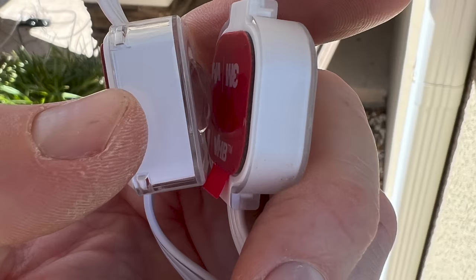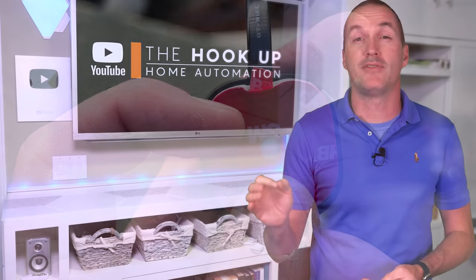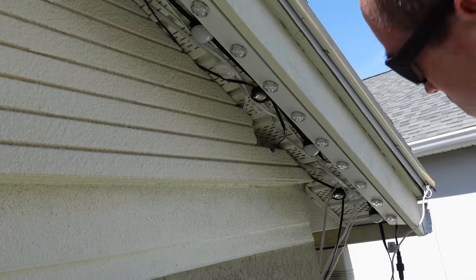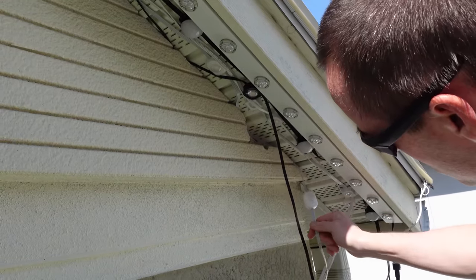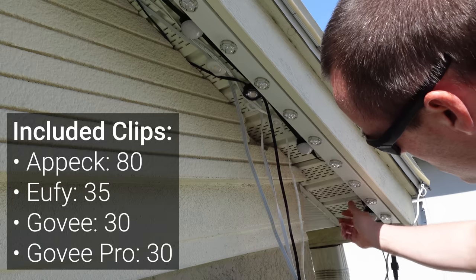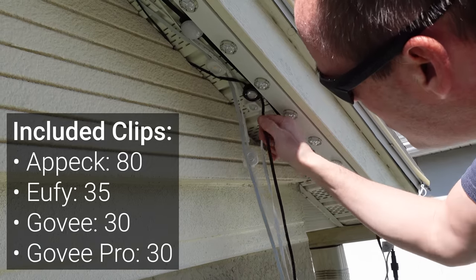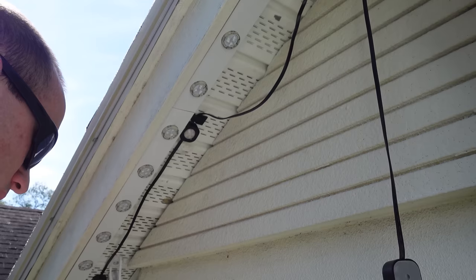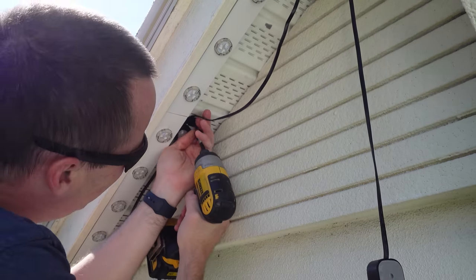The APEC, Govee, Govee Pro, and Eufy lights all come with 3M double-sided tape on the back, but each kit says the adhesive is only meant for temporary installation and that screws and clips should be used for permanent installs. Based on my experience, I would 100% agree, and I'd recommend putting a clip on each side of every node — but there aren't enough clips included, with the APEC including 80, the Eufy including 35, and the Govee kits only including 30 clips each. So you'll need about 100 additional clips for the Govee and Eufy lights, and 64 extra clips for the APEC. The good news is that the double-sided tape makes it easy to put the lights up initially, and then you can come back with clips and screws afterwards.